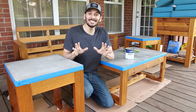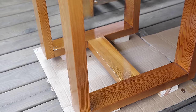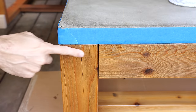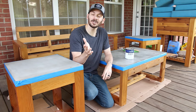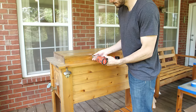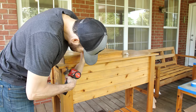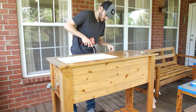Got an early start today and these turned out really awesome. The side tables look absolutely amazing. On the coffee table there is still a little bit of weathering, which is a good way to show what's going to happen if you don't sand down all the way to the bare wood. To get the patio cooler down to bare wood, I took off all the hardware and removed the finish with 80 grit sandpaper on my random orbital sander.